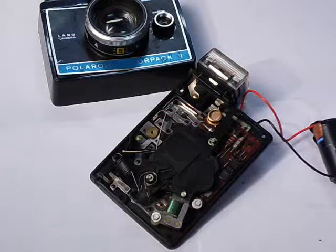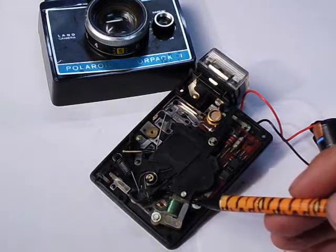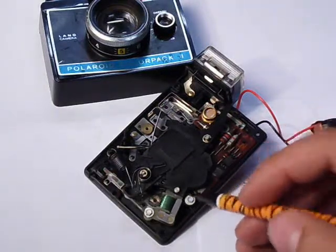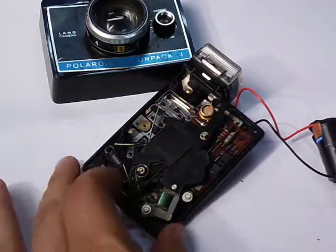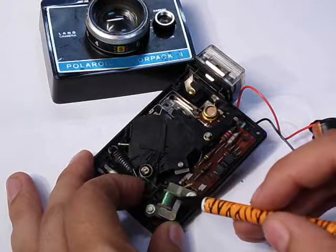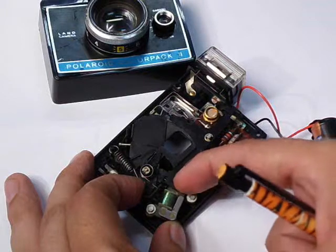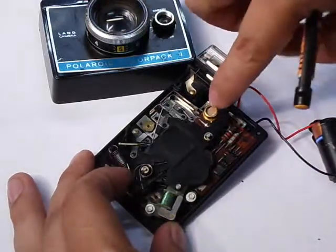It's actually really cool the way it holds the shutter open. Right here you have an electronic magnet, and there's this little metal piece here. If it wants a longer shutter, it will keep adding power to the magnet so it holds this piece open — which is the piece that holds the bottom of the shutter. It electrifies the magnet and holds it, and that's what actually holds the shutter open. If it wants a long exposure, it keeps the power going to hold it open, and then it just releases.